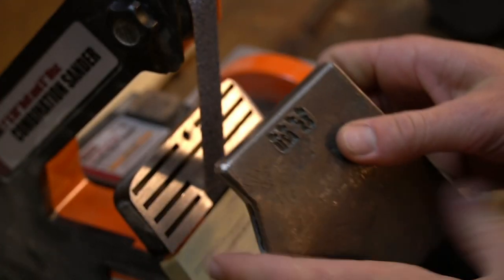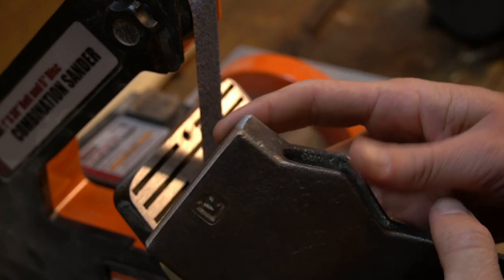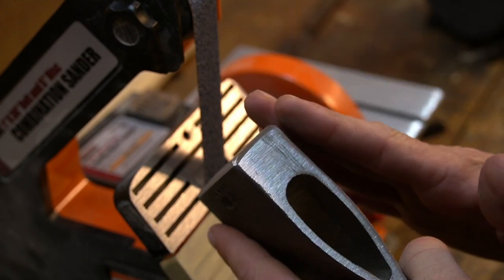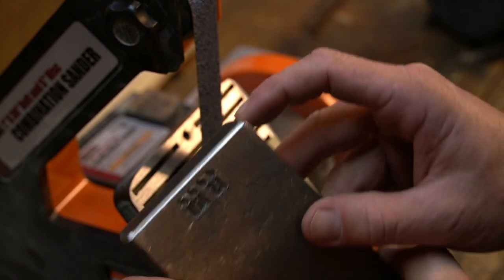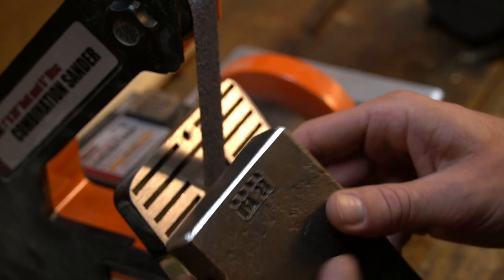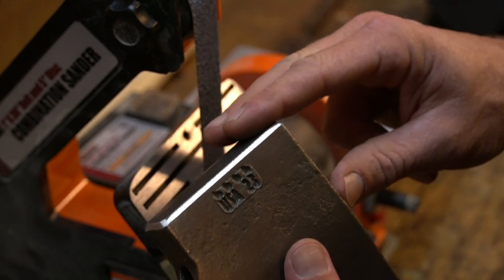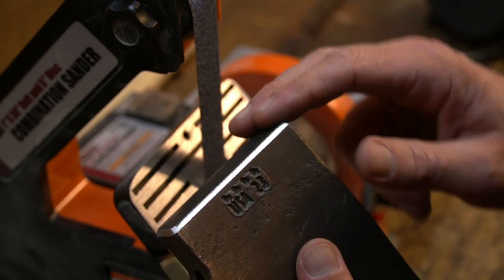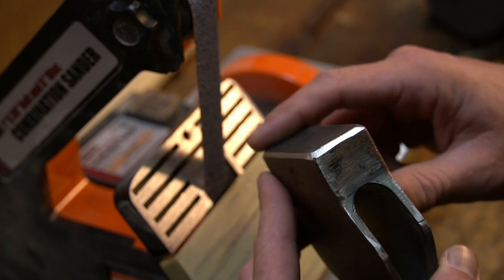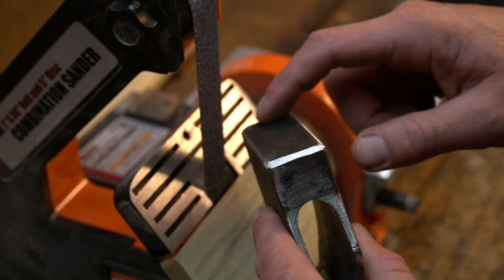So if you're wondering why we're putting a little chamfer or a little bevel right here, it's basically two things are happening here. With a sharp edge, how that was sharp right there, that's going to tear up a plastic felling wedge. And then two, those sharp edges, when you pound on something, that's where that mushrooming starts coming from. And then it can chip off and that's bad. But you're reducing the surface space of the pole, focuses the power of the head onto a smaller surface space.